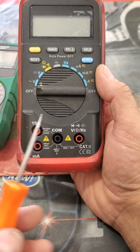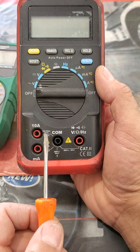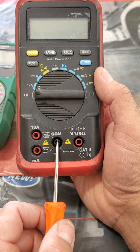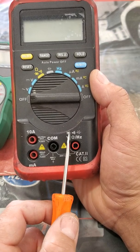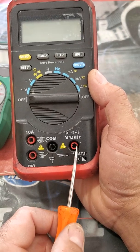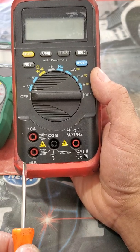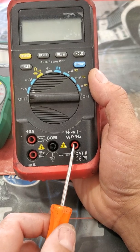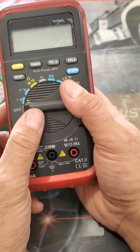There are different areas where you can hook it up. You always hook up your common — or negative — lead on this side, because that's the one that gives you your reference ground when testing. This applies to continuity, Hertz, volts, resistance, and diodes. Your positive lead goes on the other side — color coded black to black, red to red. If you want to measure 10 amps maximum or milliamps, you hook your red lead into the separate connection port.